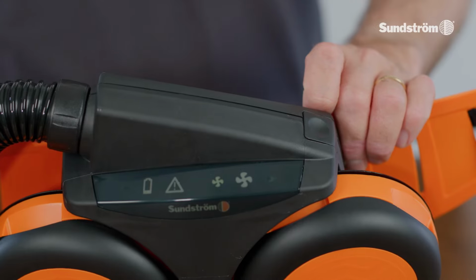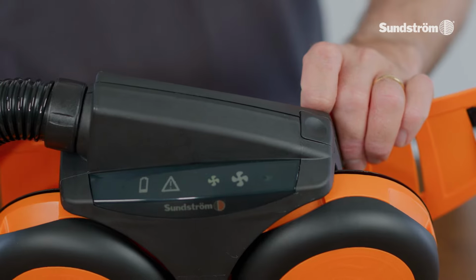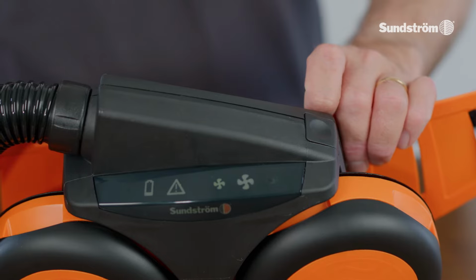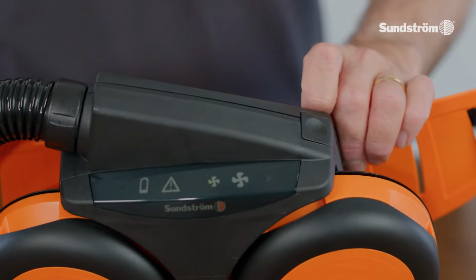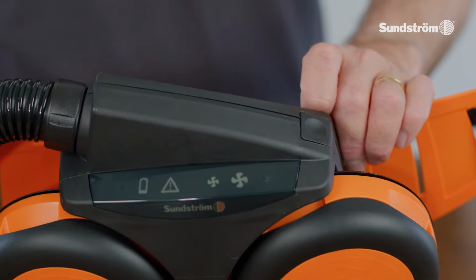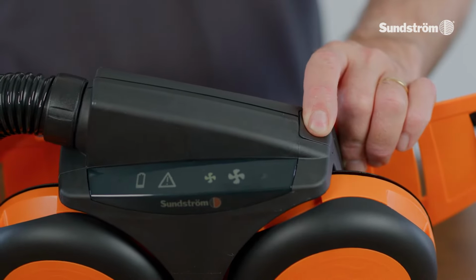Cause a flow stoppage by still holding tightly the joint between the hose and the flow meter bag, and then blocking off the flow meter outlet. The fan will now initiate an alarm by audible and visual signals. If the flow meter outlet is now unblocked and the air is allowed to flow freely, the alarm signals will cease within 10 to 15 seconds. Switch off the fan and remove the head top from the flow meter bag.